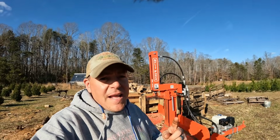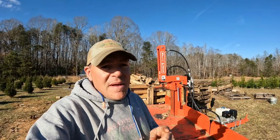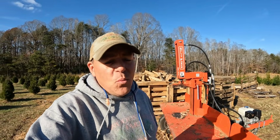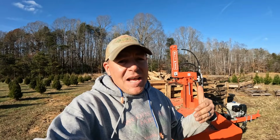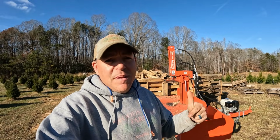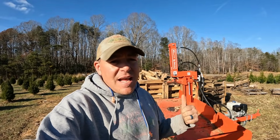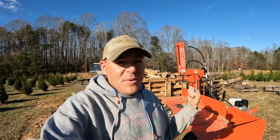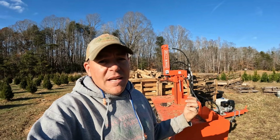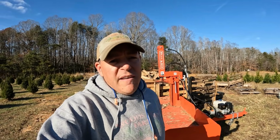There could, I think, in the future be another equipment decision which would make this machine slightly better suited than the Wolfe Ridge 28C that I had, and that is if my next major equipment purchase is actually a processor, or I might consider renting a processor for a period of time. There will likely be a lot of resplitting that needs to happen off of that machine, and a faster machine like this with its 4.5 second cycle time is going to be better at resplitting a lot of stuff than my Wolfe Ridge would have been.